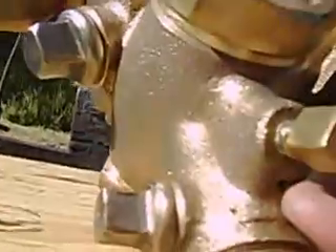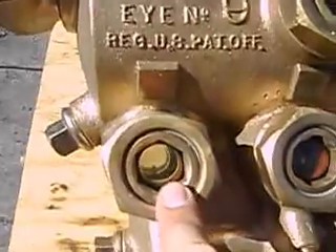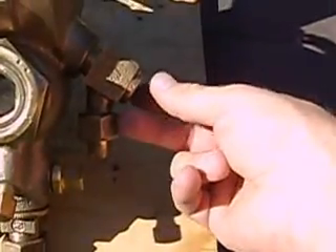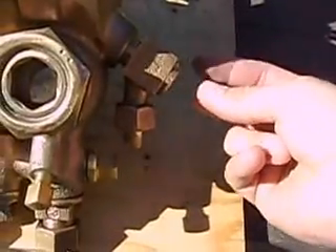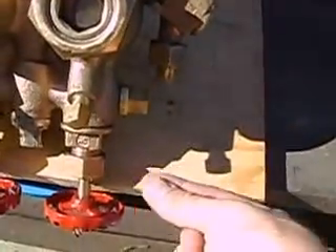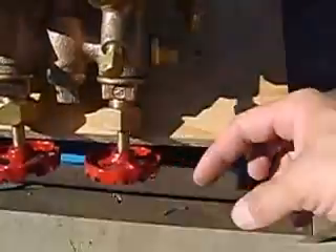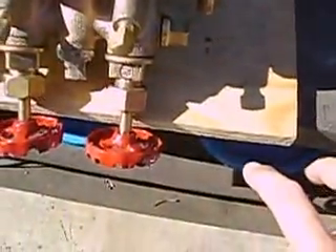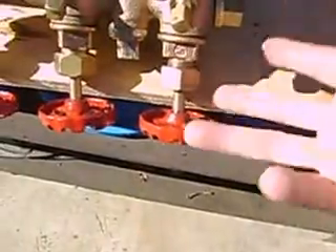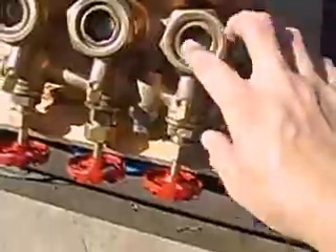You can see a little port right here. You open this up and it can blow down the water inside. This is a plug — I'm having a new plug made — but you would open this up and that would drain the water out. This would typically have a copper line that ran down to the funnel where the tricocks were, since this was typically on the engineer's side, mounted above the tricocks on the back head.